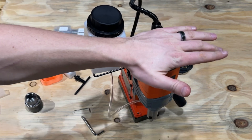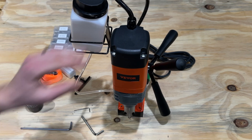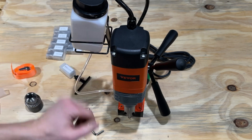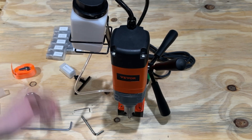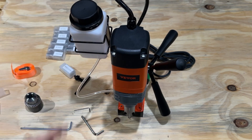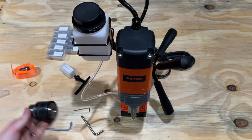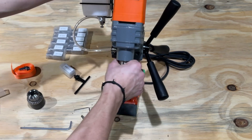Be careful lifting it up because if you didn't tighten the side screws it will still move. Now the next thing for operation would be to use this safety strap — run it through the base right here and strap it down to whatever you're drilling. Then fill this with water so you can operate the drill. That is how to install a hollow core bit.